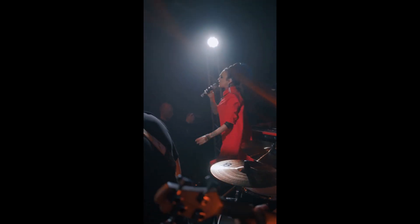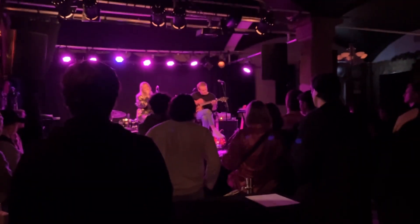Front fills are the speakers we use to solve that coverage problem. They cover the area of the audience at the front of the stage which the main PA speakers don't cover adequately. The short answer of when to use front fill speakers is when your PA doesn't adequately cover the front of the audience. You need to stand at the front where the audience will be and listen to the PA system. It's also important to choose your battles — speakers take up space, and front fill speakers are frequently placed on the lip of the stage. In a 150-capacity basement venue, you might need space more than you need the speaker.